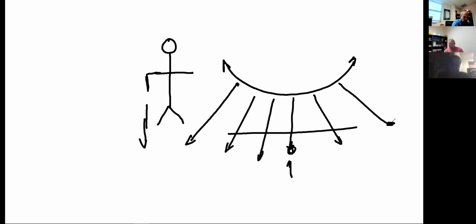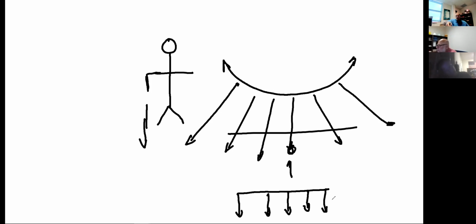Okay. Once you find the initial cable right here, take that wand and use your feet, and keep that wand head facing down, just like this. You'll definitely get more of a precision locate on the conductor. Instead of going back and forth with your hand, keep it straight, move your feet back and forth, and keep your arms straight. That'll definitely help you in the locating process.